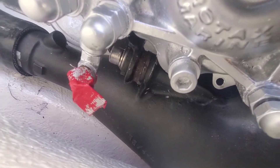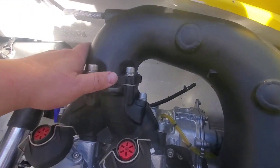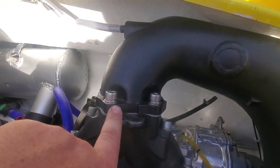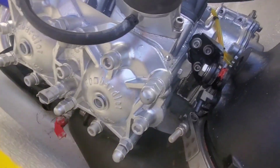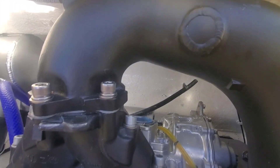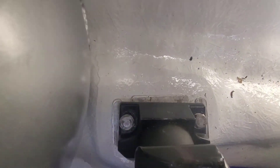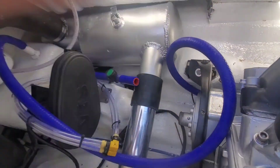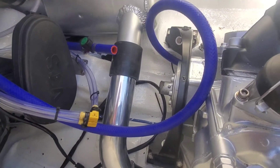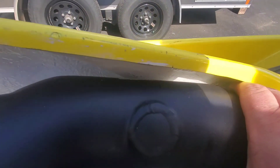So we were hitting down there, right here — it's a tight fit, but now we got everything in and bolted up. Everything's not torqued yet but everything is in place, so we know it fits. As you can see right in there, we got a tight clearance there and down there at the bottom. But we've taken out as much as we can from the pipe and the fiberglass. This engine is sitting up a little higher because we had to put in all these shims in order to get our alignment done — it's sitting up higher than on my 95 and that's causing a little bit of issues, nothing much. But we've got plenty of play so we can rock this engine back and forth, and we're good to go.